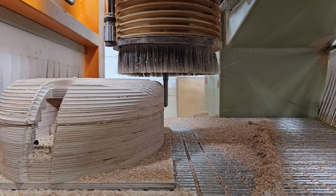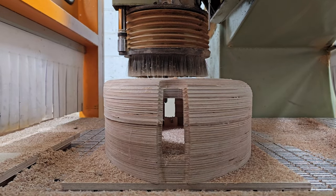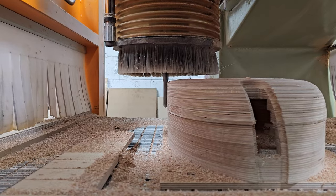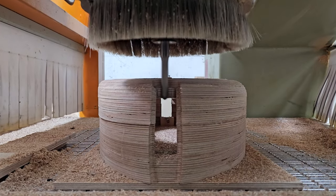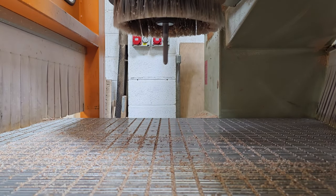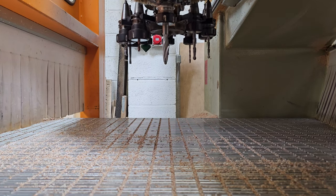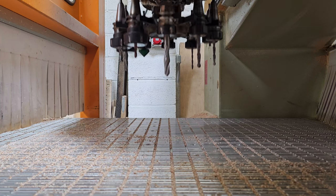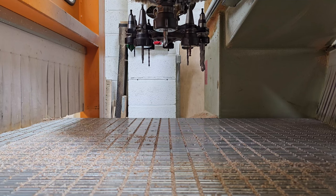And then I dropped it and snapped it, because it's a 120mm 6mm bullnose cutter, so yeah, gave up with that. Starting to build in a little bit of a pucker factor here, that was getting a little bit close. So we're going to do a pretend drill cycle that just forces the machine to move off to one side. What I found early on is when I did a couple of these tool changes, when the tool changer drops like that, it crashes into the workpiece and rips all the tools off, and the machine gets very cross with me.